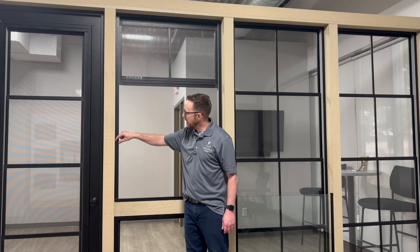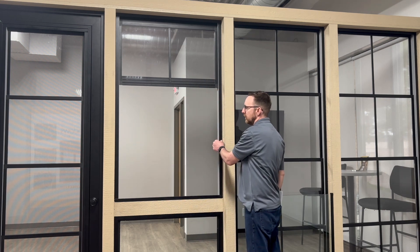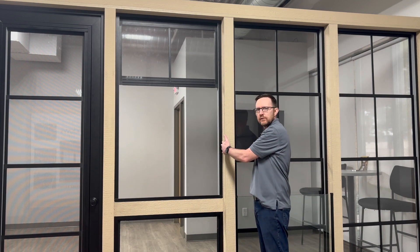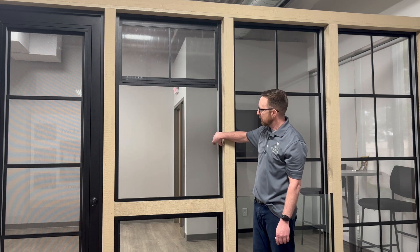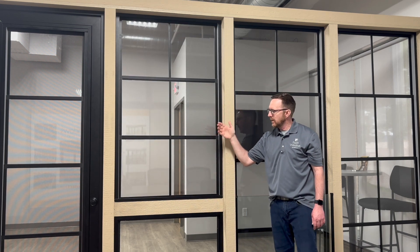On the inside of these frames, they are a full one inch thick all the way around the perimeter. So you can install this window into a rough opening and then add extension jambs afterwards that will butt right into the inside of that frame — as opposed to having to downsize the window for your jambs. This can actually be installed just like a new construction window and fully trimmed out on the inside and outside without any modifications. That is the Xtend 3-panel and 4-panel vertical 4-track windows.